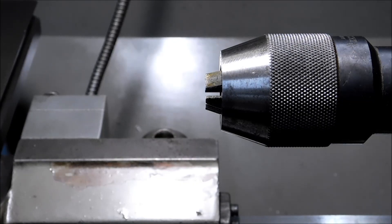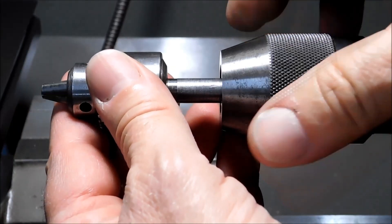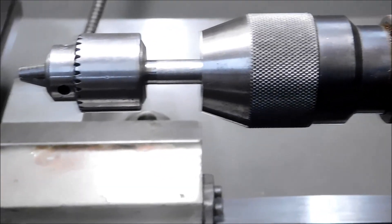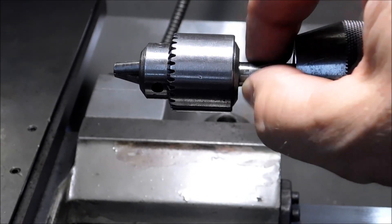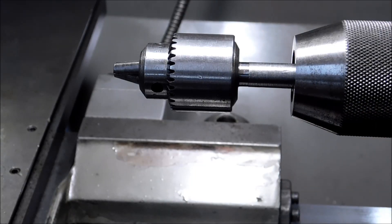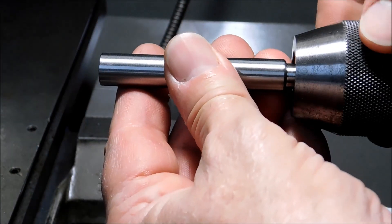Now, it's no great surprise to see somebody put a chuck in a chuck — it's not unusual. Standard tailstock, there's an awful lot of mass here. If you think you're going to feel that 26-thousandth diameter drill, you've got another thing coming. You may feel it, but you're not going to feel it like this particular adapter will allow you to feel it. Instead of putting your chuck directly into your other chuck, you have a straight shank. Put an adapter in your chuck.